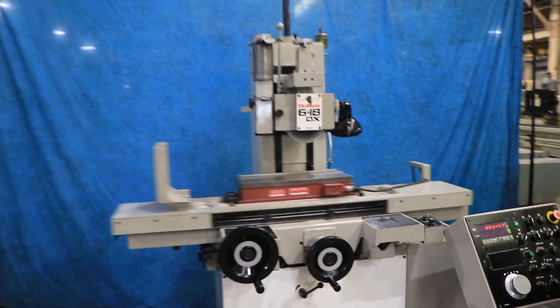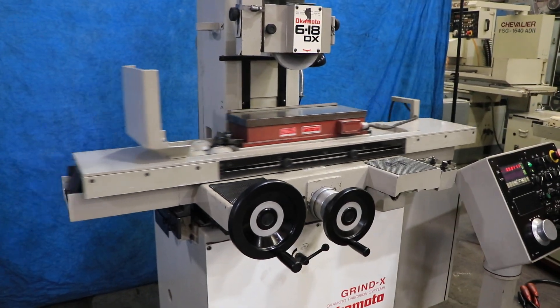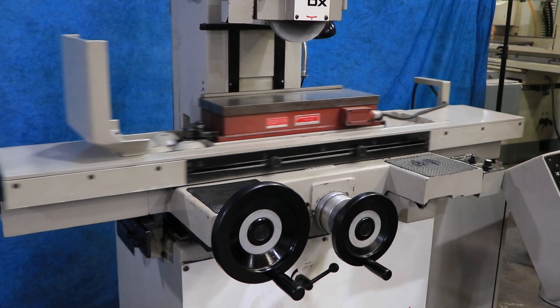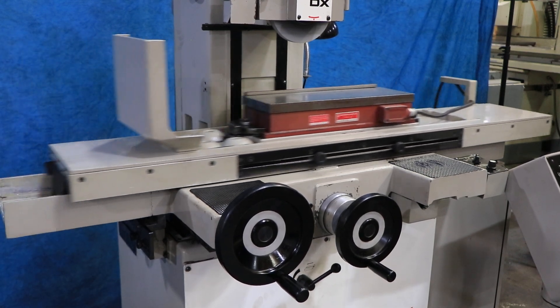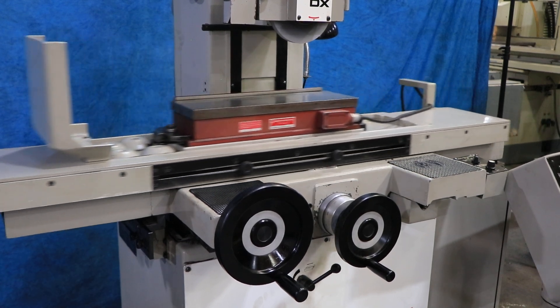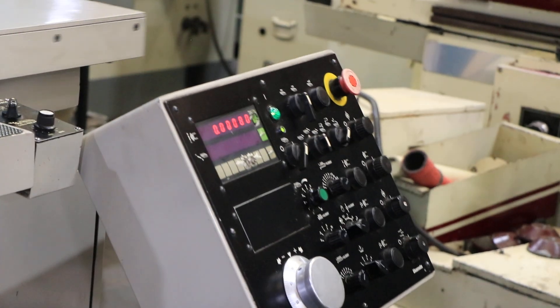Let me give it a little something for it to feed down on. I'm going to bring this down so we can show you the cross feed and its little cycle. Once we're in that setting, the table is going to go in and out just a couple times, and once it hits zero it will just park itself all the way to the right.